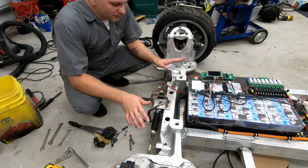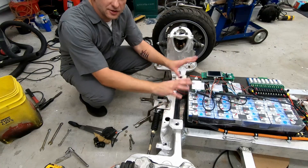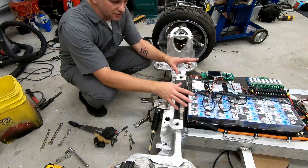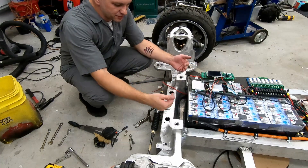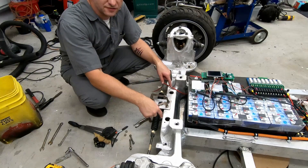Although this is not where I wanted to be welding with everything on here, we're going to toss a fiberglass blanket on top of all this, cover up what we need to to protect it, and put our grounding clamp as close as possible to our welding surface.